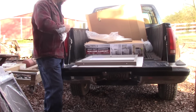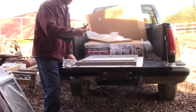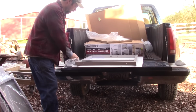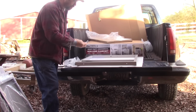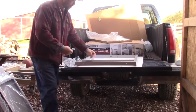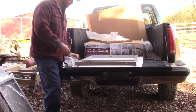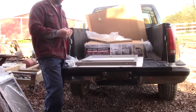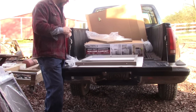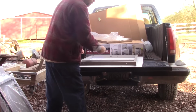Alright, so we'll get our parts. Here's our screwdriver. I'll even try their screwdriver out to see if it's any good. And here's our screws. And they even got a little old bent wrench on it. I guess it's supposed to be bent. Looks like it's a factory bend in that thing. Here's some more screws. These are slightly smaller, number 15. And these are number 14. I think these are the ones we want. Yep. Number 14. So at least they did number them. That's good. I hate when they just throw screws all together in a pack and expect you to know what size is what. We need 2 of these number 14s. And we're going to insert them from the inside through these 2 holes into these 2 places here.